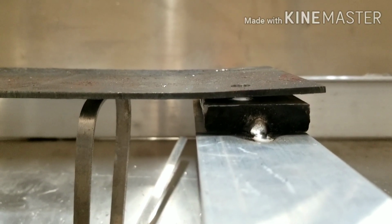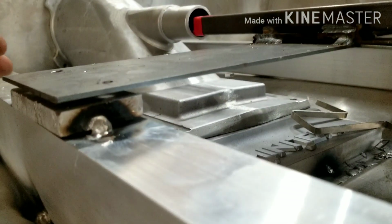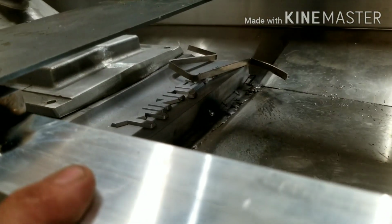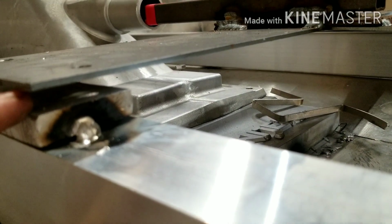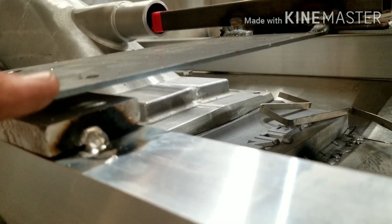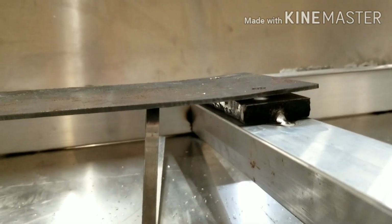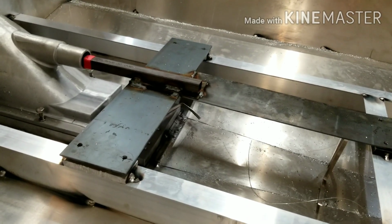So, the back motor mount has a little bit of airspace in between, and the side ones do as well. Obviously this plate isn't level, but our motor mounts are. So this moves a little bit, but that gives space to add shims. And like I said earlier, it's easy to go up but it's impossible to go down, so I wanted this to be a little low. Also, being that the back part of the motor mount is 3/16 lower than the other two motor mounts, it's just going to make life a lot easier to shim up the front.